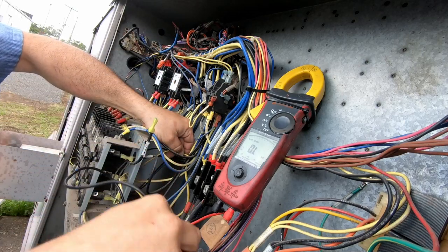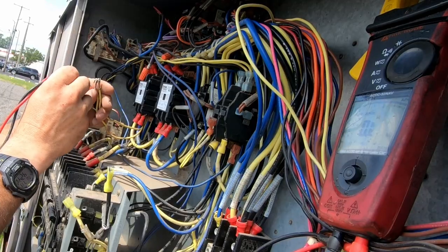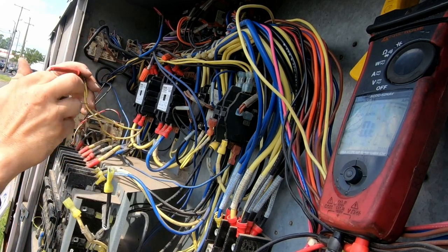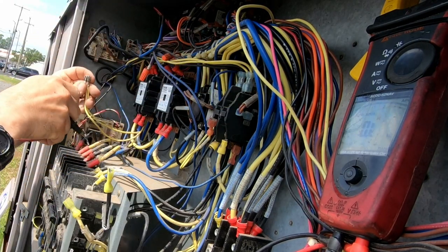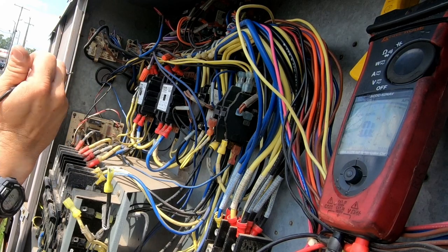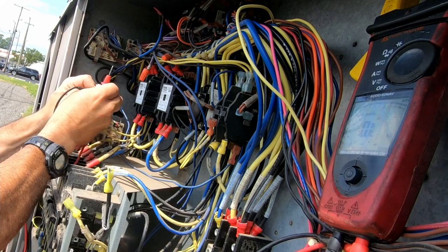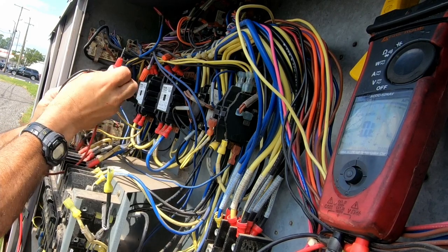This one's shared with the transformer though. Pretty sure the transformer is this yellow light wire here, and this is why you want to make sure your power is off and locked out. These are the ones that are shorted. I'm picking it up on my meter there - I'm hitting resistance, it's not beeping right now. It's not low enough, so let's undo these two and find out which one's the actual culprit.